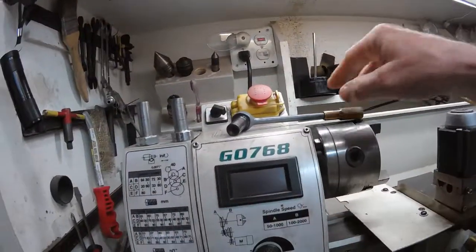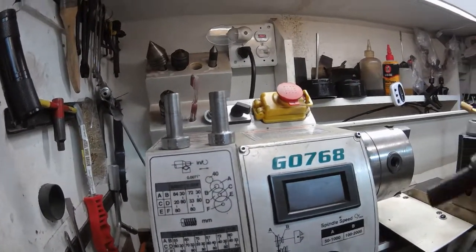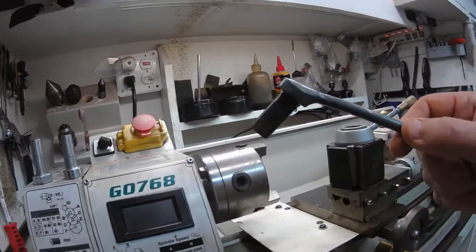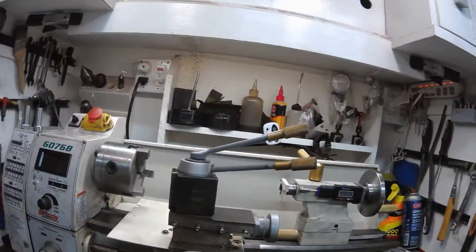What I have done is take a hex bolt, spin it down to a cylinder, and then take a piece of metal rod, drill a hole in the top of the cylinder, and it simply inserts and acts as a compression nut — and you don't have to find the wrench every time you want it.